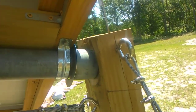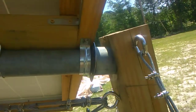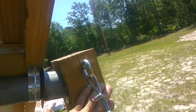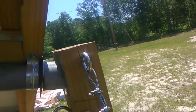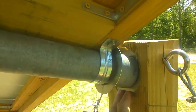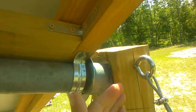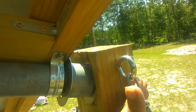The reason for that is when this thing's moving back and forth over time, it's going to want to grind out the back of the hole, because the weight is thrusting downward into this pole and would eventually eat out the back side of this post. So with this coupler on here, I could put a thrust washer in front of it for the pipe being thrust into this post, to keep it from eating out the back of this post.